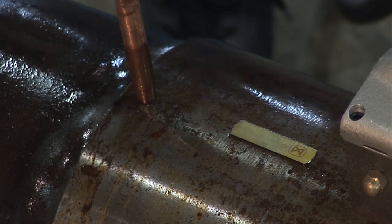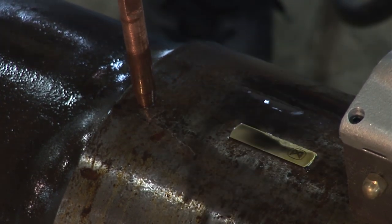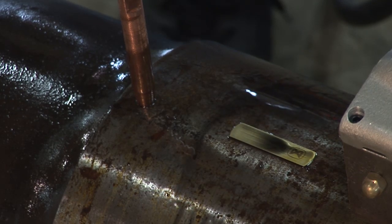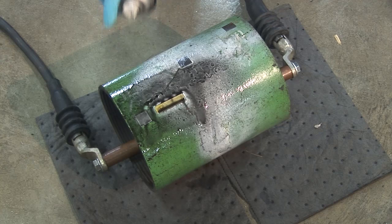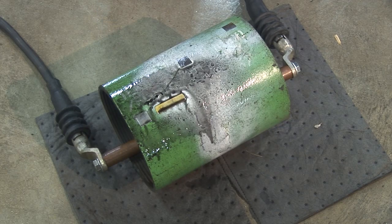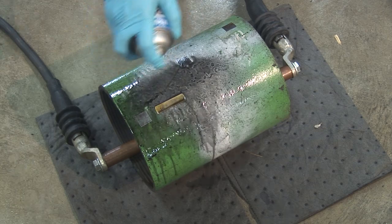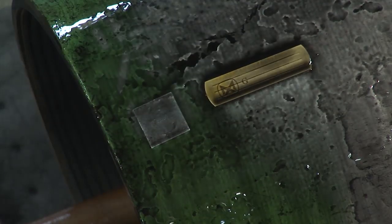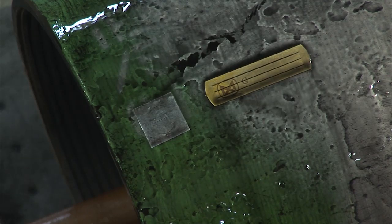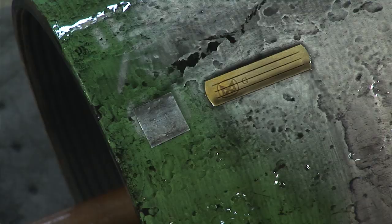The formation of indications on a magnetic flux indicator is demonstrated here. Prod magnetization is also possible to do with fluorescent particles. Here is an oil field type coupling used to show how the unit can be used to perform central conductor magnetization. This copper rod is resting on the bottom of the bore, but the field generated with current being sent through it is still strong enough to sufficiently magnetize the outside surface on the opposite side.